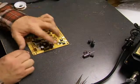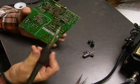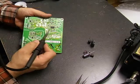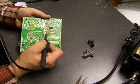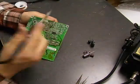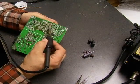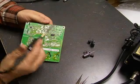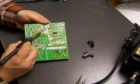That's the ones in this cluster here. The easiest way to do that is just take your board and your soldering iron. You heat up one of the legs of the capacitor, tilt the capacitor on the other side of the board until that leg pulls through. Then go to the next leg, pull it through, and remove the capacitor. You do the same thing as you move around the board — heating up one leg, pulling it through, heating up the other leg. Sometimes you may have to move it in and out of the board a couple of times to get the capacitor legs free from the board.